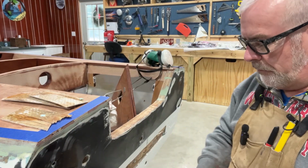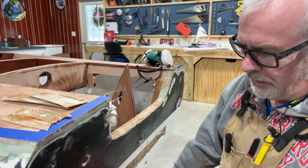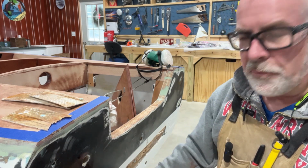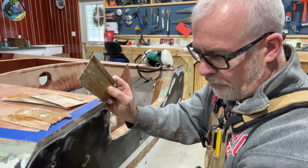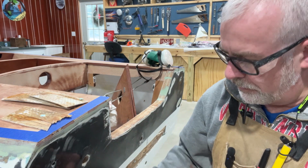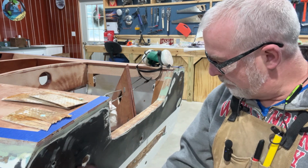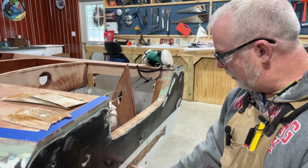What you saw me doing was demolition on my transom. You get to see this beautiful new fiberglass transom wood core, but from here to here it was not even laminated, and that is because more than likely I thought I had enough resin in there in 2002. These are screw holes which I used to tighten it up, and I thought I had it tightened up, but for some reason from here to here, this space did not receive enough resin to bind it.